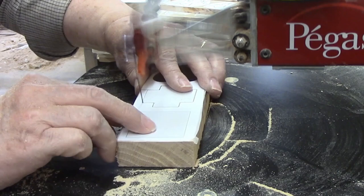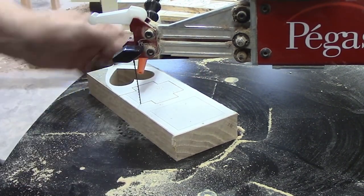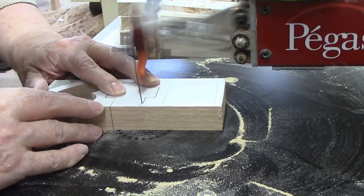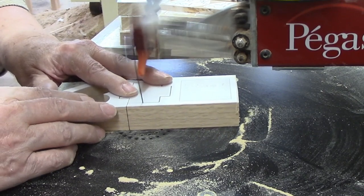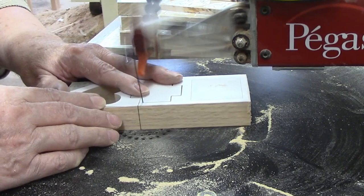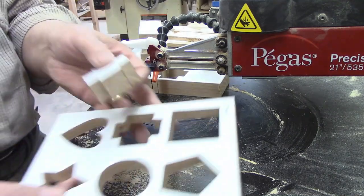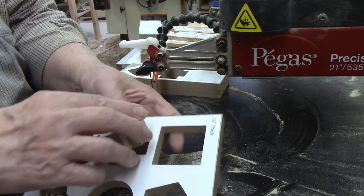The plus sign was a bit of a challenge to cut because of the 90-degree angles. I cut to each intersection, backed off slightly on the blade, and then used the saw blade kerf just created to pivot the workpiece 90 degrees to the next direction I wanted to cut, then started feeding the workpiece into the blade once again. I counted them — this shape has 12 90-degree corners. I hadn't noticed while cutting the plus sign, but the sides are not the same width, so this shape will fit only when the longer sides line up with the longer openings.